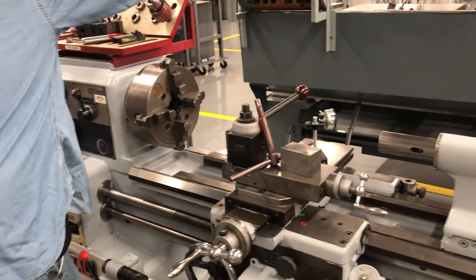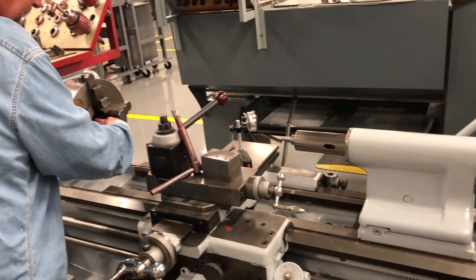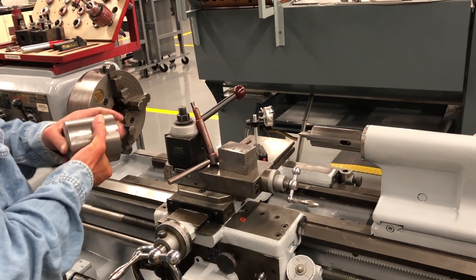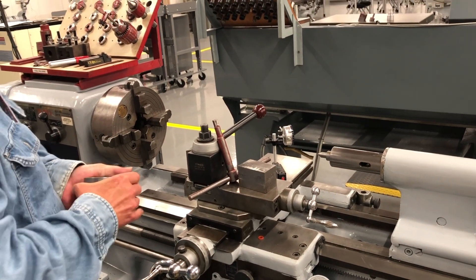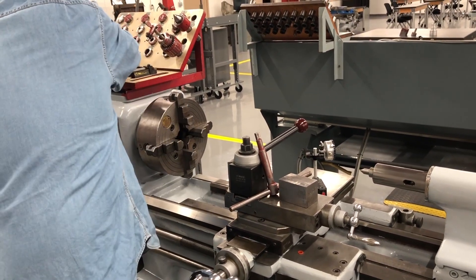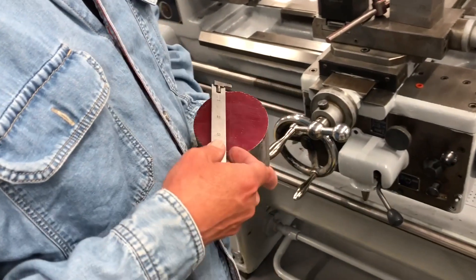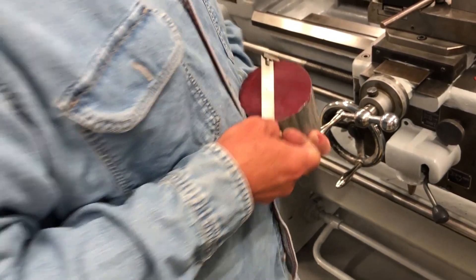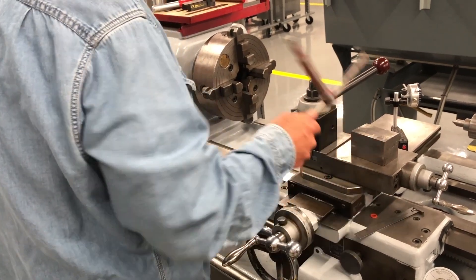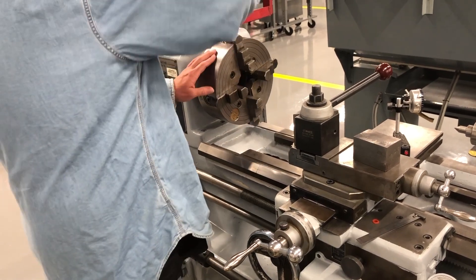We stick a center here — the center of the spindle should be exactly in line. I take my six-inch scale and measure: it needs to be three and a half inches. This is absolutely critical. I'm going to talk about the jaws a little bit.